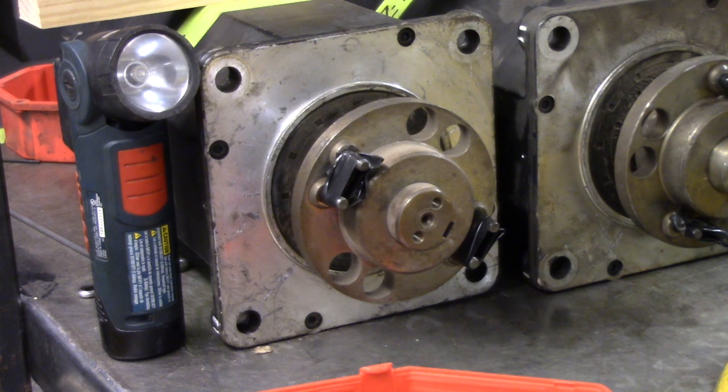Notice, if no motor movement occurs, an error was encountered. AC-DC users can troubleshoot drive errors through the HSC bit screen definitions as described in the AC-DC manual. Okay, so the next page. Keep running the move sync operation until the encoder reading is closest to zero or its maximum encoder count, which is 40,000 in my case. The encoder reading is circled in figure 4.